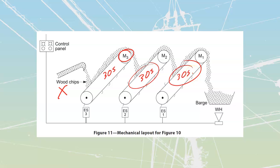Generally speaking, you're going to hear about clean out timers, more so than use an off delay. You'll just have people that'll say, oh, you need to have a clean out timer on that so that we can move stuff. There's a lot of materials that will move really, really well when they're already in motion. But once that object goes to rest, it gets really hard. And so if you don't clean out a loaded conveyor or augers or things like that, what can happen is if you shut it down full, you're actually going to have to dig this whole thing out because it can't start underneath load.